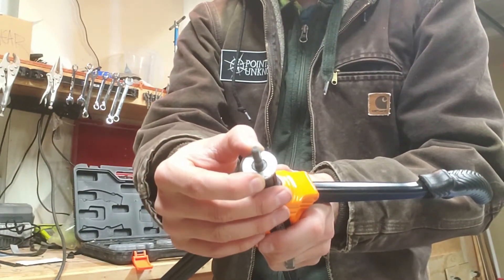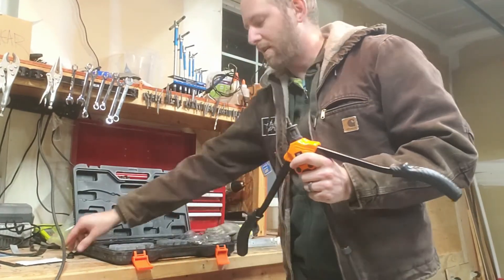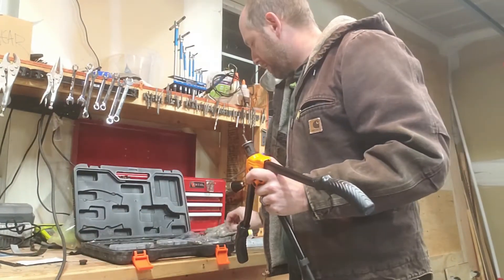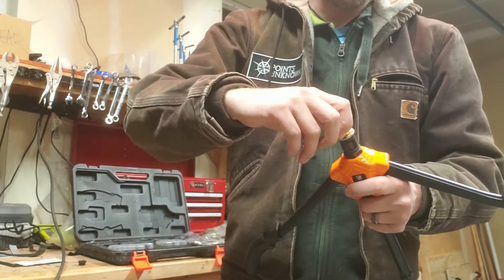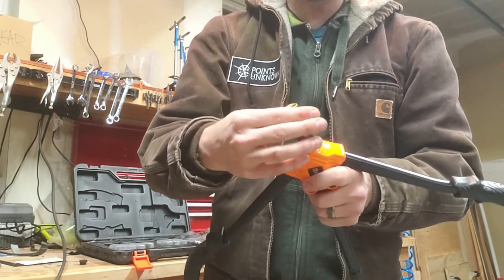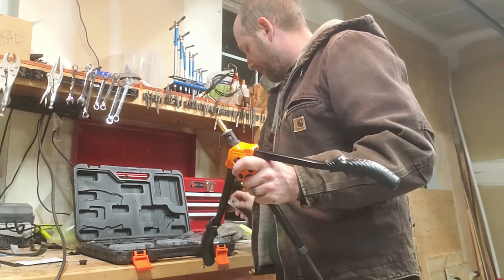The three-eighths washer fits right around that quarter-inch mandrel very well. Because I've gotten rid of the anvil — which had some thickness to it compared to the washer — it gives me a little more length of the mandrel to screw down the PlusNut. So now my PlusNut is actually mounted just a few threads deep, but enough to get it onto the PlusNut.